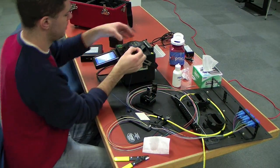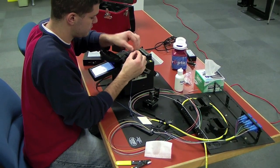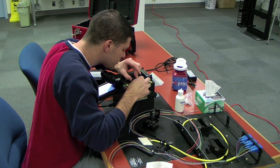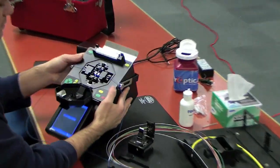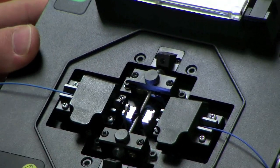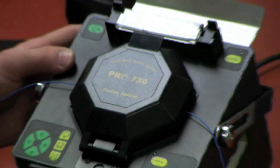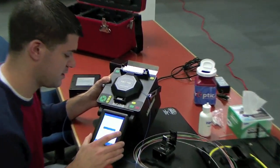I'm going to lay this fiber in here. And again, almost up to the electrodes but not touching it. There we go. I have both fibers almost to the electrodes — might be hard to see on your screen, but almost touching the electrodes but not crossing the center line. So now I'm going to hit this green button — that is the set button.